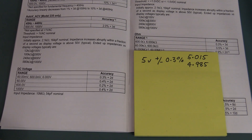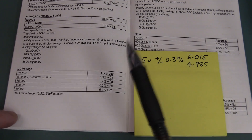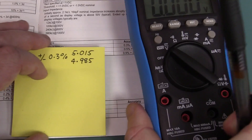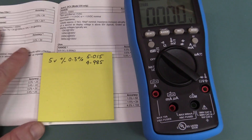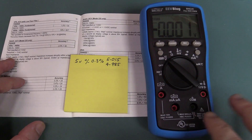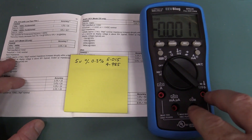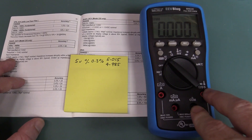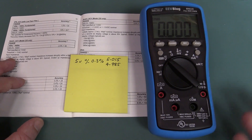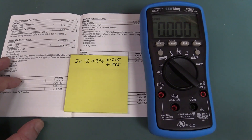Not just on one meter, because that really doesn't tell you much - effectively doesn't tell you anything, you've only got one data point. But if we can get say 50 multimeters, that can give us a good indication. A meter like this is actually software adjusted, so they will feed in a reference voltage generator and actually program the exact figure in there - or that's what they should do.